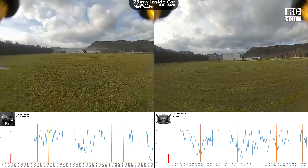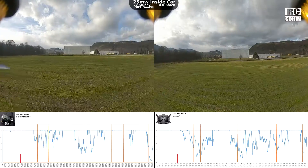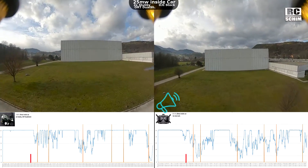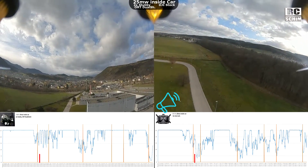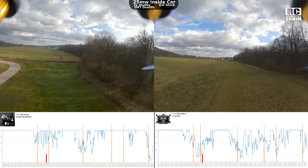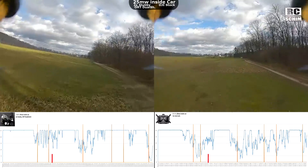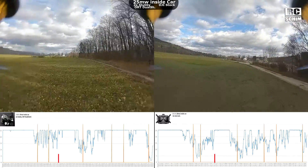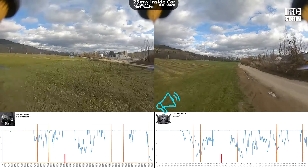In the axle chart on the bottom you see a red cursor moving which corresponds to where the copter is, and the blue line is the bitrate — if it's up it's good, if it's down it's bad. Those orange spikes are landmarks to sync up my video. The image doesn't look terrible, but I might want to bail out with this antenna setup sooner than with the other. It's definitely worse over the construction area. And this is where the patch antennas on the last run had no advantage.